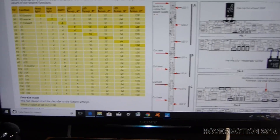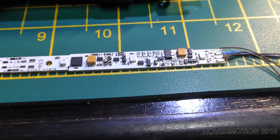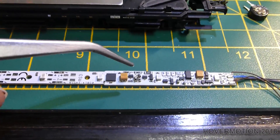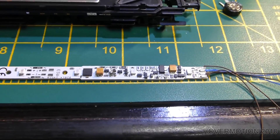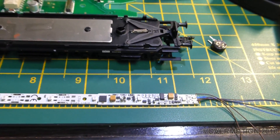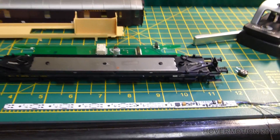There's quite a lot to take in on these lighting units because they're quite advanced — all the chips and decoders are programmable, all on that tiny little part of the circuit board. You've also got a potentiometer there; if you want to adjust the brightness of the lights manually you can turn that as well. If you haven't got a decoder programmer, you can actually do that manually — especially if you're using it in DC or analogue mode.